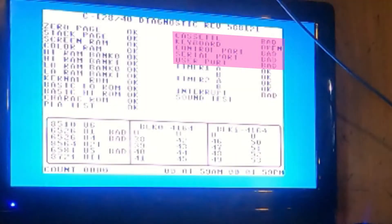So remember when I said that not having loopbacks in place gives you the bad cassette, controller port, serial port, and user port results? Well, one thing it won't give you bad are the actual chips — they should still test fine. I totally overlooked that, figuring it was because the loopback plugs weren't in there. As you can see, this is reporting both my 6526s as bad, and my SID chip, and I really have no way to test all of these at the moment. So I'm going to be picking up some more chips and doing some diagnostics in another video.